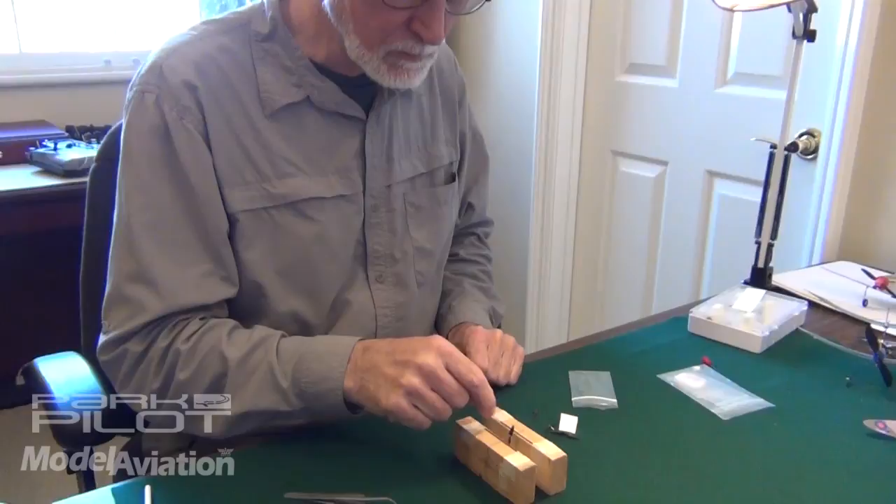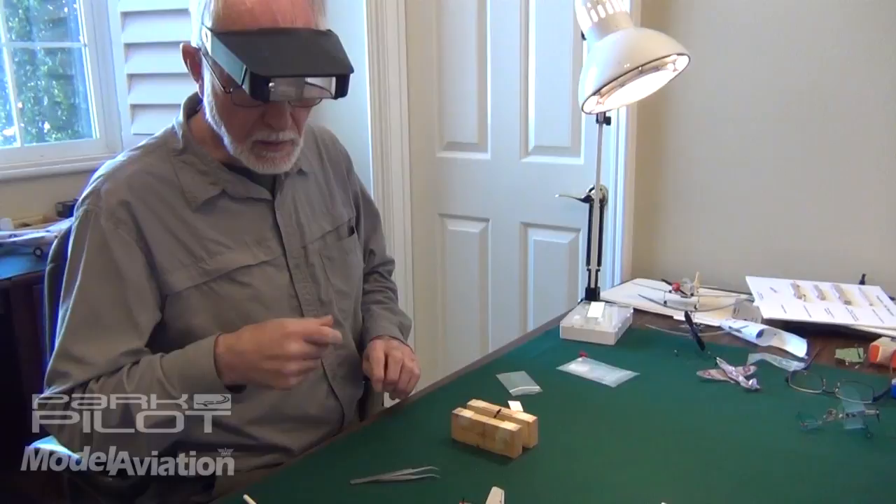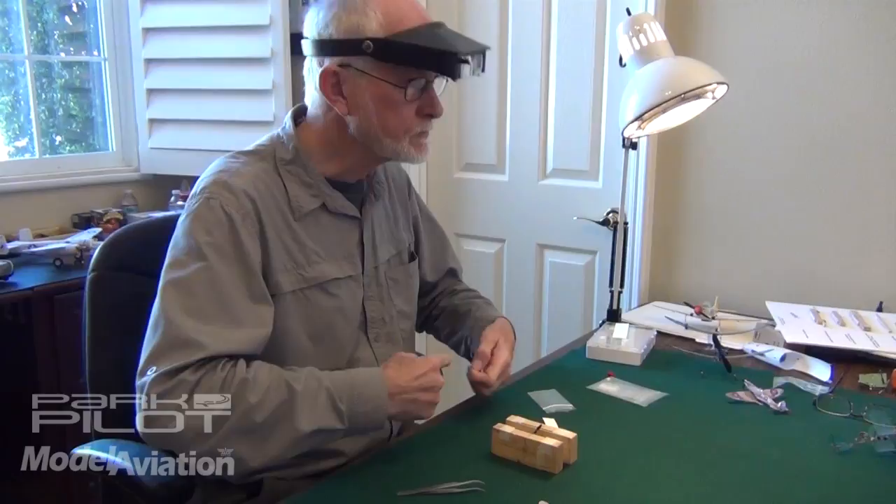So then the heavier blade — what do you use to take it away? Just a little piece of emery cloth. Put it on the side of the block — it's emery cloth wrapped around a little piece of brass tubing, actually — and sort of rub it like that. It actually doesn't take much.